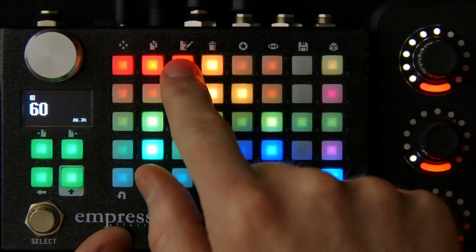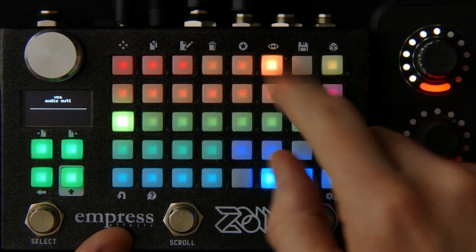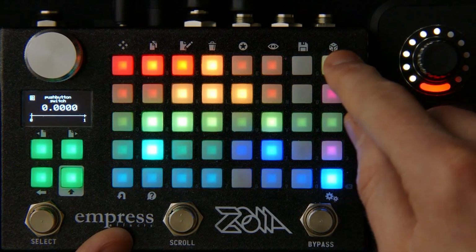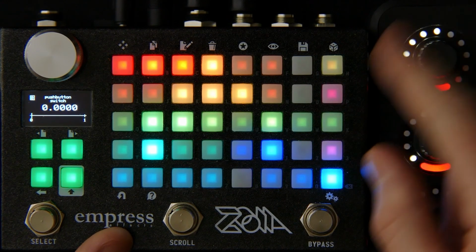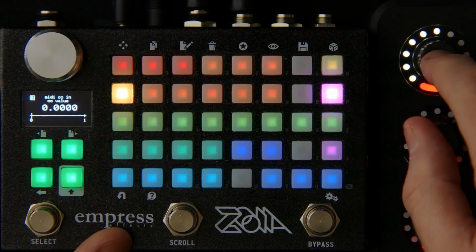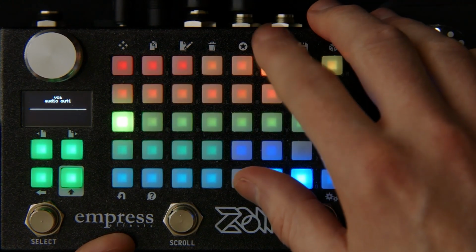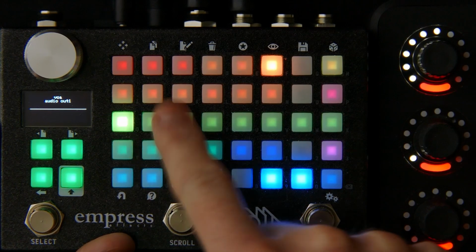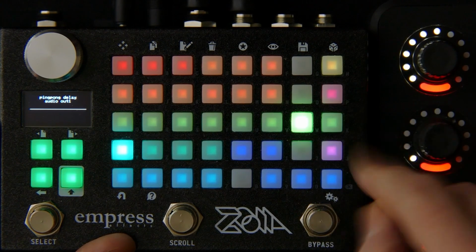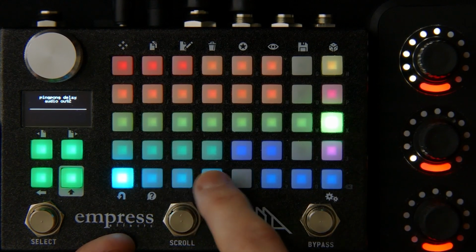So I've got an oscillator running a triangle wave going into a VCA, and the VCA is controlled by an ADSR envelope that is triggered by this button here, and also through a MIDI module it's triggered by this MIDI input here, which is this button here. And then the output from the VCA here is patched into the ping pong delay, which has a mono input and stereo outputs. The left stereo output goes to this panning module. The right stereo output goes to this panning module.